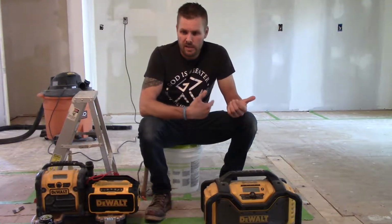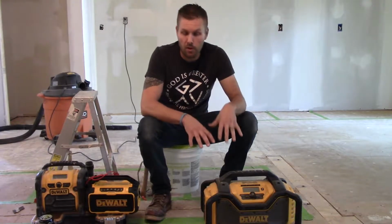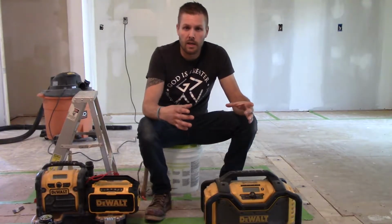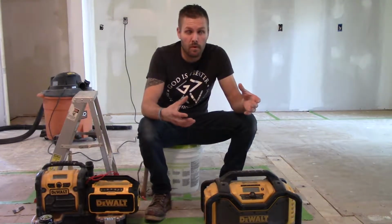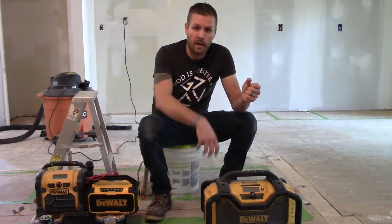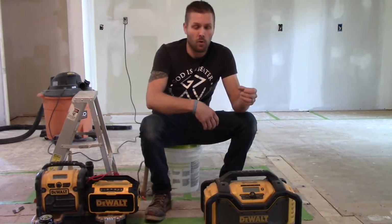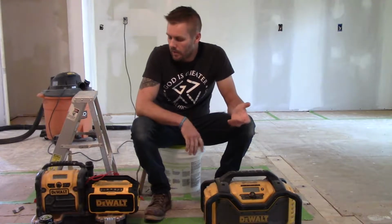But what I did was, in the room that the main is below the floor, I'm cutting in a 4x10 register floor grate that I'll have sealed off. But in the case of an emergency and needing to shut the house water down, I'll be able to just pop that floor grate out, reach down and turn the main off. Or if we leave town, whatever we want to be able to shut the water down for.